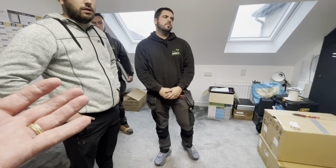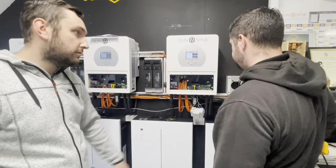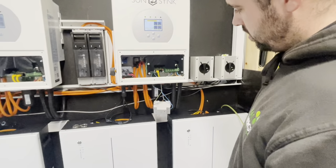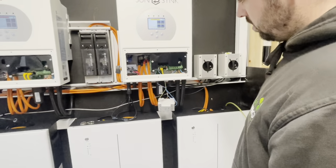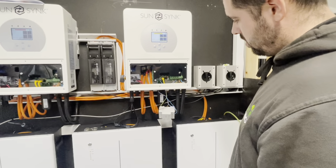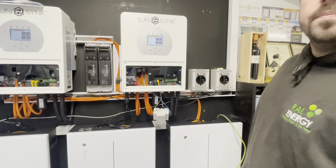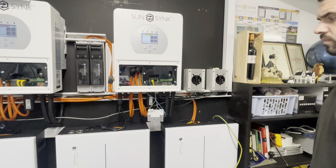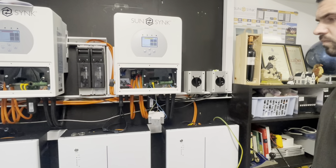It's not rocket science to work out the type of relay you should be using — it's just a case of feeling comfortable with it. Make sure you put a fuse in the live wire because you need protection if there's a problem, and the relay needs to be put into a separate mounting box. It should be fairly simple.